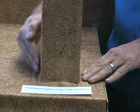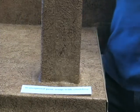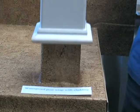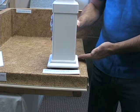Wrap the membrane around the post six inches up and then use something like this — a vinyl fence post — to slide over the top and use some vinyl trim to give you a nice finish to it.